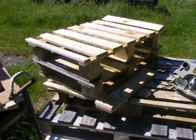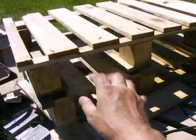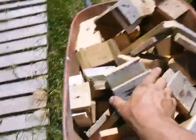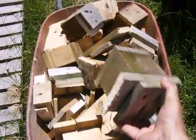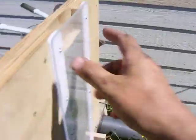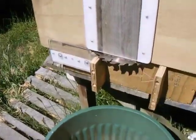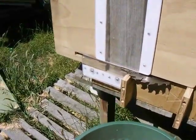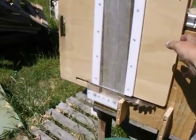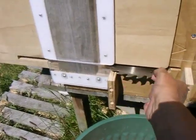I hope All Power Labs doesn't mind my borrowing their name. Using the skill saw I cut a whole bunch of these to produce the benzene bars, and I'm left with what I call beaks and claws which burn very nicely so they can be my winter heating in the fireplace. The benzene bars I slip into this little fuel chute here and they sit over this blade. When the slide is pushed backwards you can see the benzene bar will drop into place against the backstop so the blade is now able to cut it.